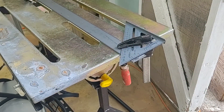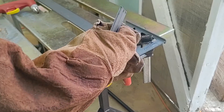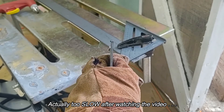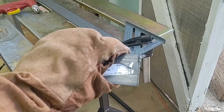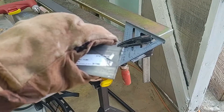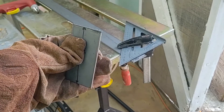As you can see, that was a nice cut. I might have gone just a hair too fast — there's a little bit of an angle there. Top side looks good, just a hair bit of dross on the back side at the starting point. First time I've ever used this — actually, first time I've ever even plasma cut. So you can see a little bit of dross there, probably a little bit of shock factor. Anyway, that's the first cut — very successful, very fast, very clean.